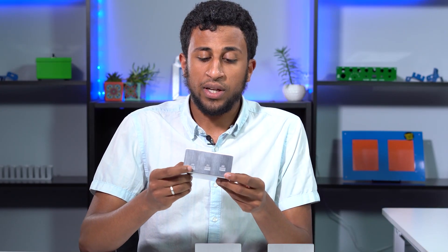In a previous Proto Tech Tip video, Motaz covered the concept of minimum bend dimensions. We've got a link below so you can check out the full video as well as a blog post on the same topic. But to give you a short version, a minimum bend dimension is the distance that a cutout should be from a bend in your sheet metal design.